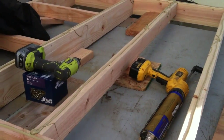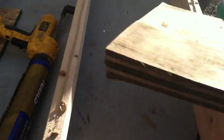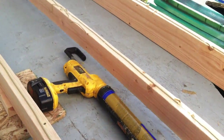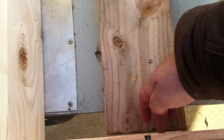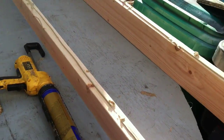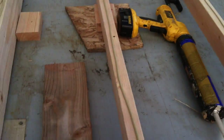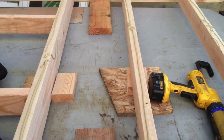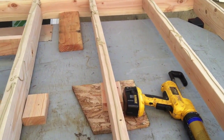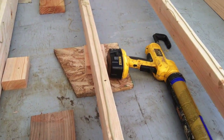You've got to tighten it down in order for the glue to dry. Watch out at this stage not to trap any leftover debris or tools underneath there as you screw down the panel. I left a little bit of fudge factor in the spacing — if I need to square this I'm going to be able to shove it square when the panel is up here by screwing a corner, making sure things are shoved square, and then following the lines around. My main purpose for the screws isn't necessarily structural strength but to make sure it tightens down really well so that the glue hardens tight, not soft or with a gap.